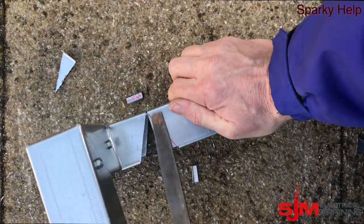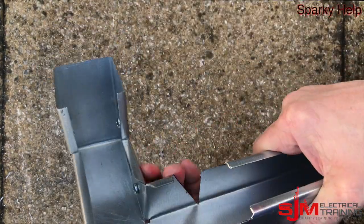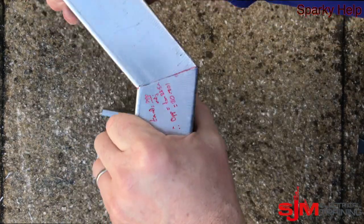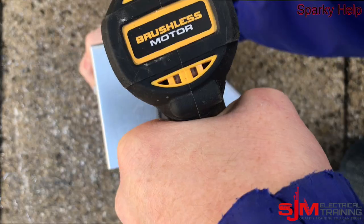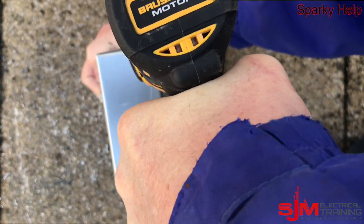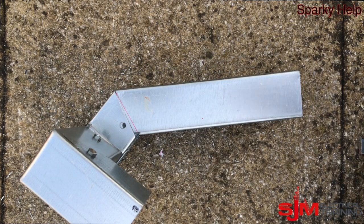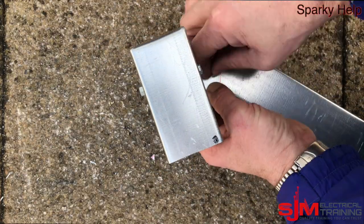Why would you want to do this? Well, we could go and buy them, and this is what it would look like if you buy them — but this one I took a picture of: it's made up of internal bends only, so the externals are actually internal bends, and how you get their lid off I don't know. But we're just going to do one side of that to set up. And then that's our 45 now, and we can check that against our square — there's our 45, and you can see they are bang on 45. Then drill them through and fix them, a couple of holes either side. The good thing about making your own bends is you have earth continuity continuous because you don't actually break the trunking, provided they don't cut all the way through, and nothing bolts them in position.